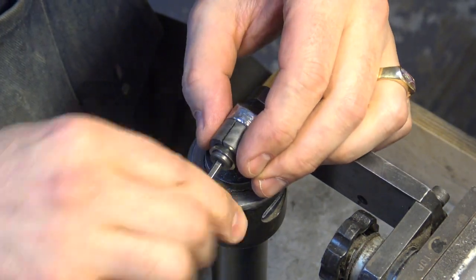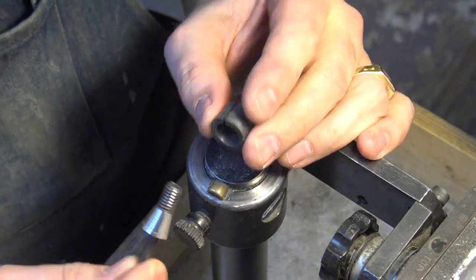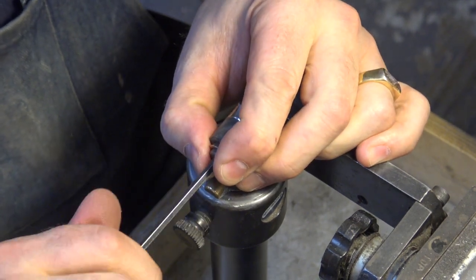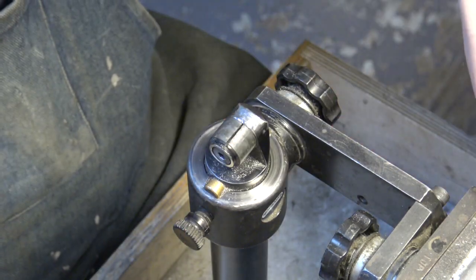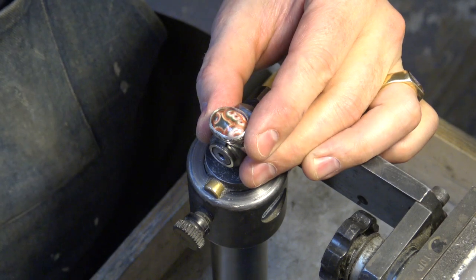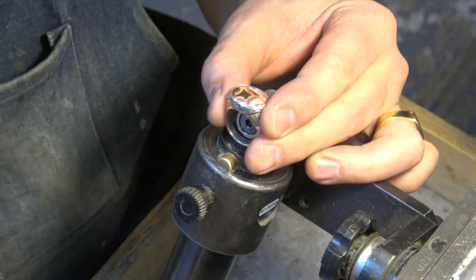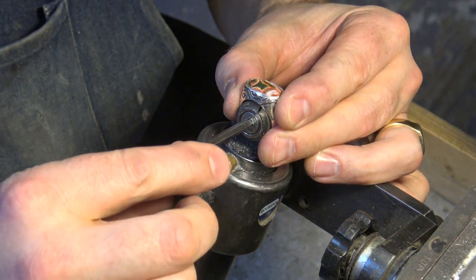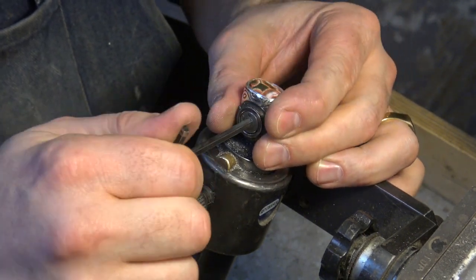And it gets fed onto this. So you put the cylinder here, like this, tighten it down slightly, put your ring in, give you a side angle, there you go. So you can see that this slides right in like this. Put the Allen wrench in and just start twisting until it tightens up.